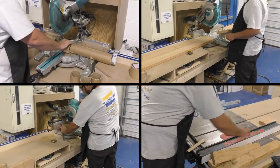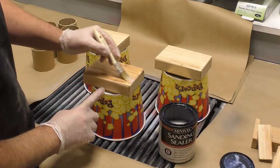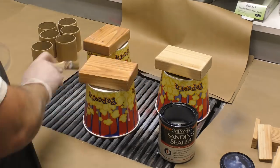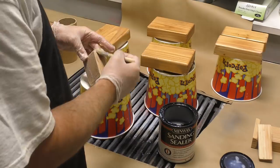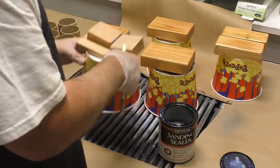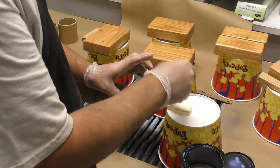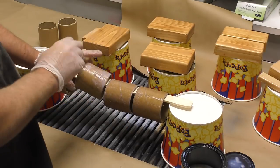I'm going to cut these to the sizes that we noted earlier and then proceed to seal them using some sanding sealer, applying at least two coats to seal the wood pattern so it doesn't show up on our casting. The cardboard tube pieces that we cut up to use as space holders for our casting are also going to get sealed with the same sanding sealer.